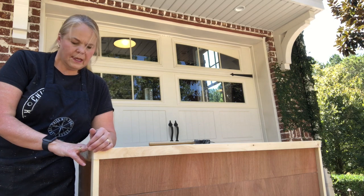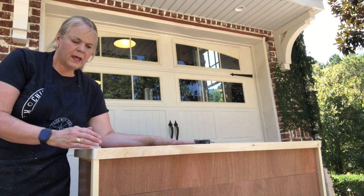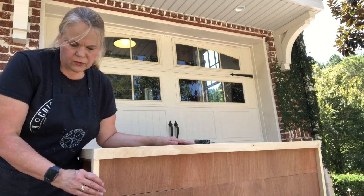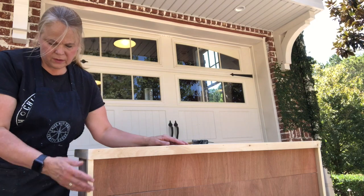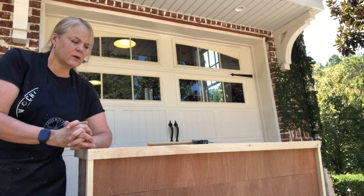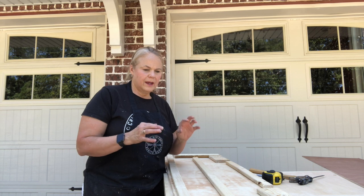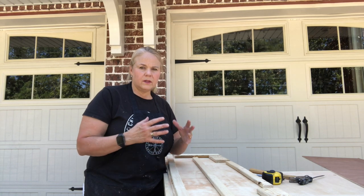This is the progress so far today. I've put a half-inch piece of nice sanded plywood on top and trimmed it out with 1x2 material, using the miter saw to cut that. Down the sides I also trimmed it out with 1x2 — partly to make the shiplap look nice and even, and also to bridge where the two kinds of trim come together. Now I'm working on the drop leaf section. I'm making a wood sandwich because the drop leaf needs to be a bit thick for the hinges, but I don't want the weight of something super thick.